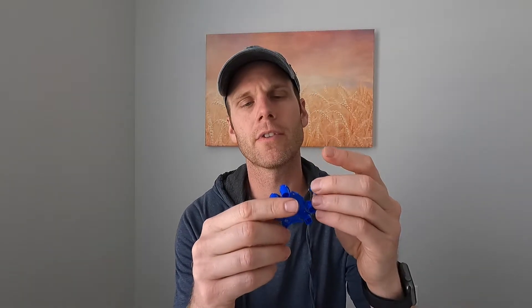I've already pulled off the 2.0 nozzle — it's really easy. When you have them on the strip that comes with your Rainbird head, you just twist them and they break off relatively easily. Before installing, make sure there's no leftover plastic from where it was attached to the others. You can scrape it with your Rainbird tool or a flathead to make sure it goes into the mouth of the sprinkler head without snagging.